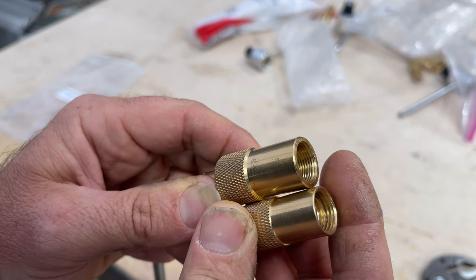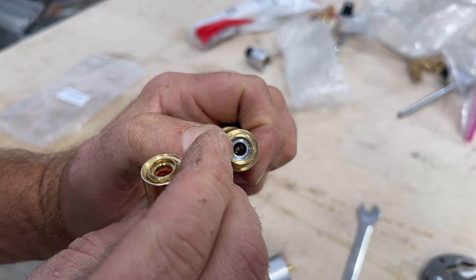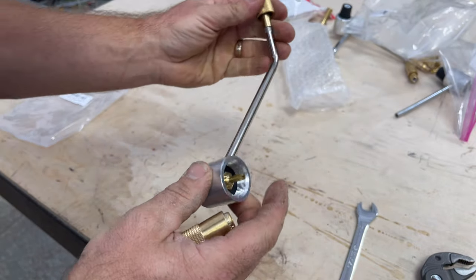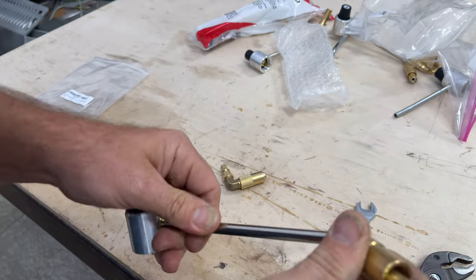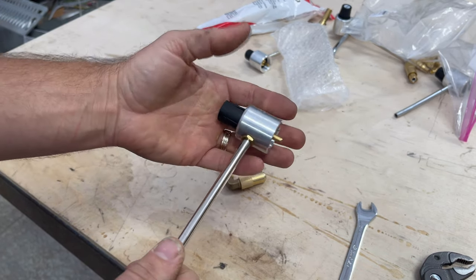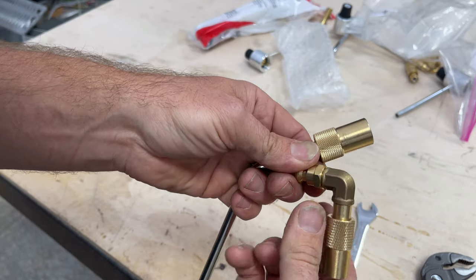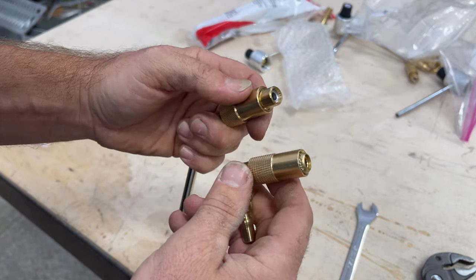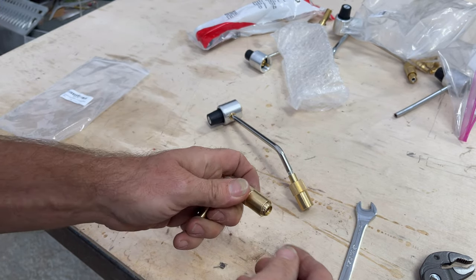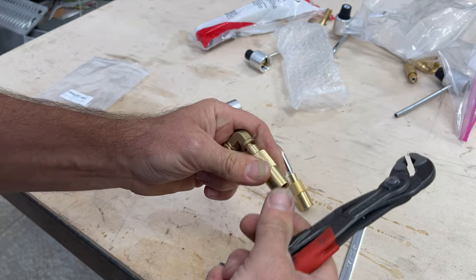Can you see the difference? The top one is more fine thread, this one is more coarse. And if you look inside, the zerks — or whatever you want to call them — are different. This is the one that the Everest needs. This one will work on your Everest stove to attach a hose adapter to your propane tank, or it will attach to a one-pound green can. Our goal is to make this into a quick disconnect for either a trailer or overland rig setup. A lot of people are frustrated saying I'm missing steps — this is a DIY project, so do it yourself.